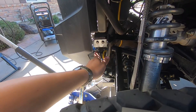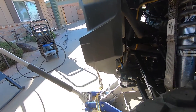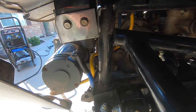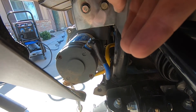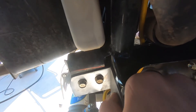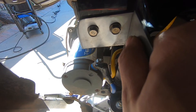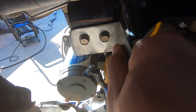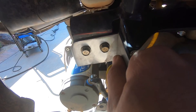I went ahead and smoothed out this edge with a grinder and took a flapper wheel to it. Now I've removed the bolt from the upper A-arm. I'm going to take the other half of this coupon and do the same thing. I don't know if you can see in there on the top — it's not a perfect 90 degrees so I'm going to mark it, clean it up, and then put the bolt back in and tack it. Let me go ahead and get this one drilled out.